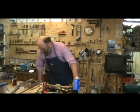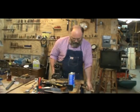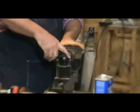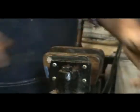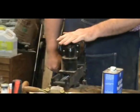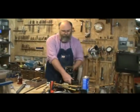Now this arrangement — I believe it's made by Wheeler Engineering — it's called a pattern maker's vice. And after you get to the point where you've got some shape to your stock, or you want it up a little higher, then this thing works out. As you can see, these rotate, and whatever shape your stock is in, it works very nicely. Just kind of tighten it up. And this also has the advantage of being able to swivel. So as you're working one way and you need something that's a little more comfortable, instead of trying to stand on top of your vise or on top of your bench, just move the vise.